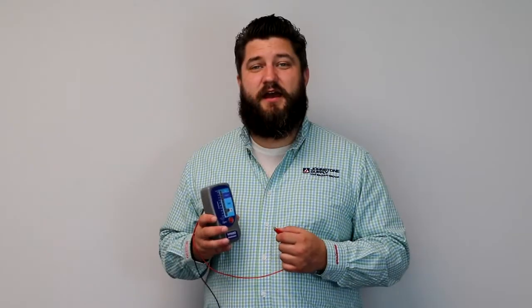If you are 30 to 100 megaohms, which is in this caution area, you should be preparing your end user for the imminent failure of the insulation in their system. Anything above 100 megaohms, the insulation should be in good condition.